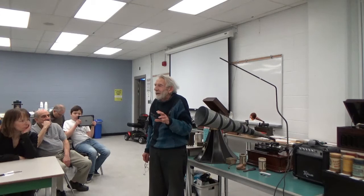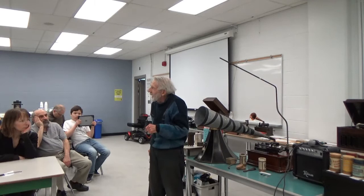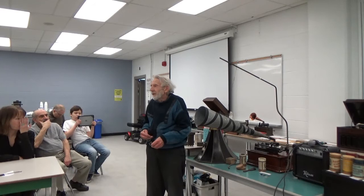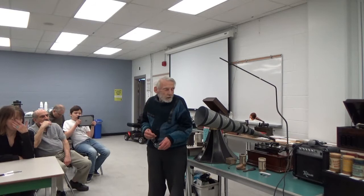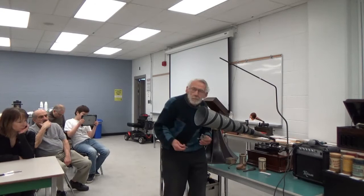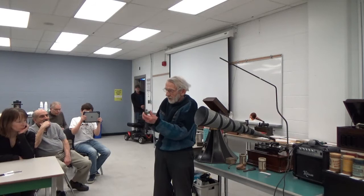So the question is, how do you play them back? Now, I have had extremely good luck at playing my early Class M North American wax cylinders. I don't play them on that machine because it is brutal on records. But what does work is a Model O reproducer, and I think most people with cylinder machines are familiar with the Model O. And you can counterbalance the weight of the stylus by just putting an alligator clip out on the end of it.